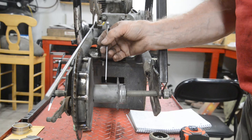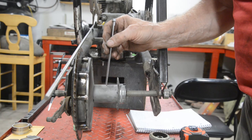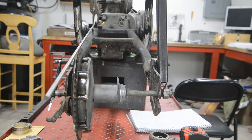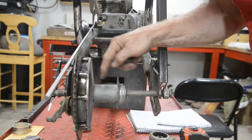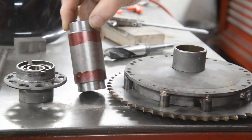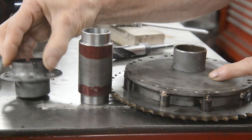Exactly the same as we did in the front hub, I'm going to cut that, then make a stepped piece so that there'll be 2 5/8 actually there, and then about another 1/2 inch which will fit inside of that to keep it all really square and concentric with the spindle when we put it back together. So let me go and put our mark on here, as you remember, pop it a couple of times so I keep the spokes right, and then I'll cut that out and we're in business. And I won't forget about the width of the cutting tool. So there's the extension piece finished. So I'll press it into there and pop that on the top.